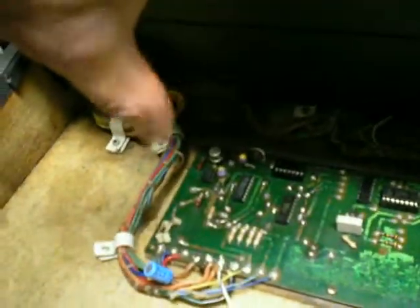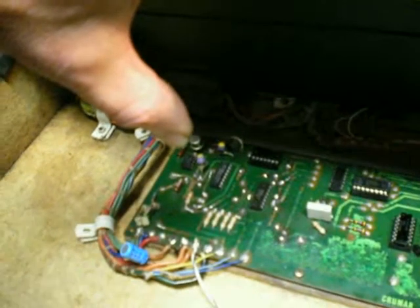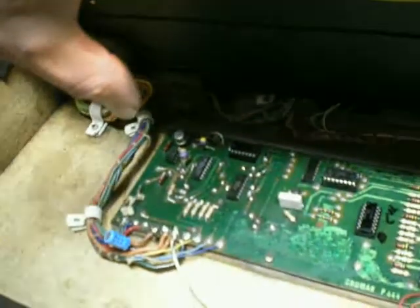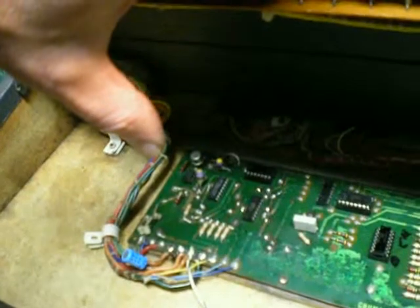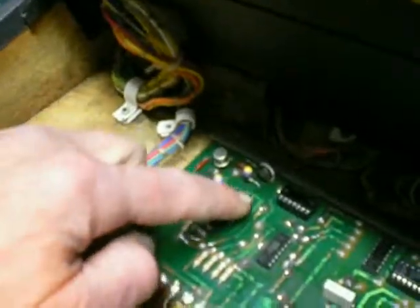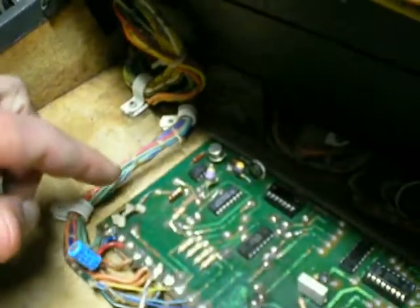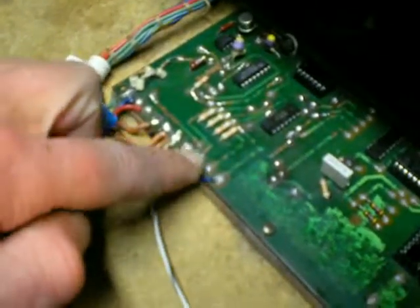Anyway, let's look inside at what we've got here. The poly synth board is underneath. This is under the keyboard. We've got a dual bus keyboard — two springs per key and two wires per key. One set of wires comes off to this board, which has an oscillator with a voltage control circuit over here. That is the original DCO design, the original digital controlled oscillator, which is actually analog controlled because it's simply charging up a capacitor-resistor network and charging and discharging through this one-shot chip here, this LS-221 chip, and then it's driving a logic network here that decides which waveforms. These are from the waveform switch, these wires here.